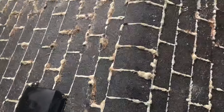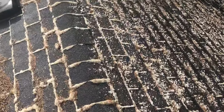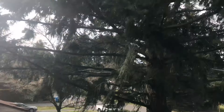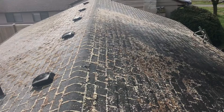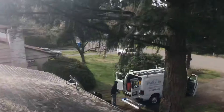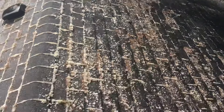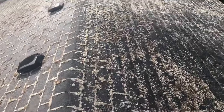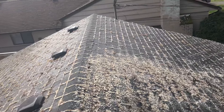We're done with our service here. You can see the blanketed moss on the front of this house due to this evergreen tree — the branches span halfway over the house. I would recommend removing some of those for this homeowner just to get some more light on this roof. Luckily we have our soft wash solution, or else they'd have to pressure wash or brush this off all the time, which this three-tab roof wouldn't last long with.